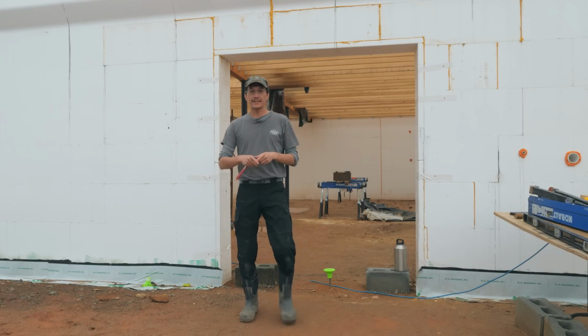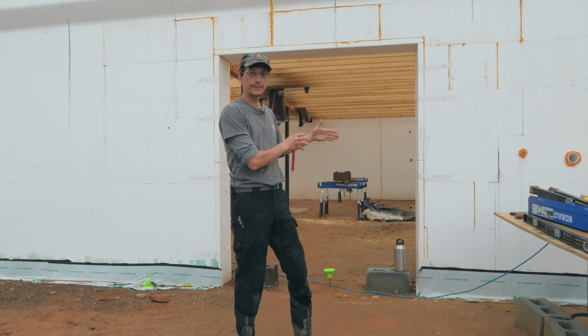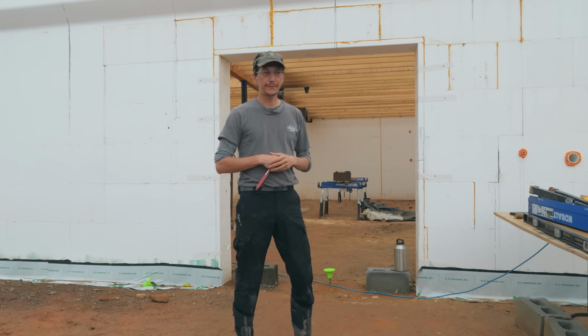Welcome back to the Mountain ICF house build. Last video we finished putting in the floor joists for our first floor subfloor. 2x12, 16-inch on center, super stiff, super level. Took us about a week and a half around the weather we had, but man, we ended up with a nice stiff floor.